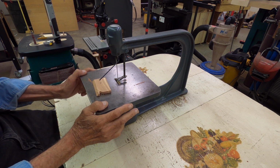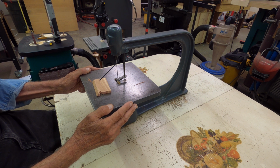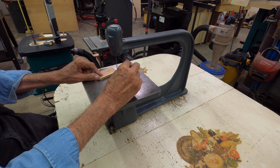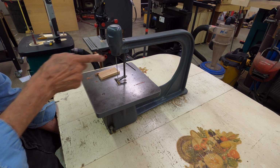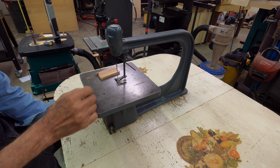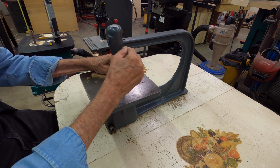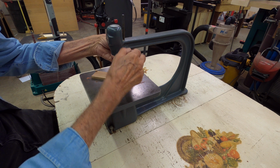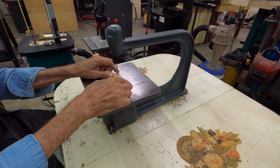And you've got to remember, this was sitting on the floor when I used to use it as a kid, because it didn't have a table or a stand. It was on that 2x8, which was just sitting on the floor in the house. So anyway, first he had to loosen this Allen screw, and that lets the spring retract the top clamp. And then underneath, at the time I could use the pulley, but you have to run the blade down. And now this guide is in the way, so what you have to do is either raise it like so, which I didn't use, so I put it to the back like that. Anyway, and then you can slip your wood down the hole.